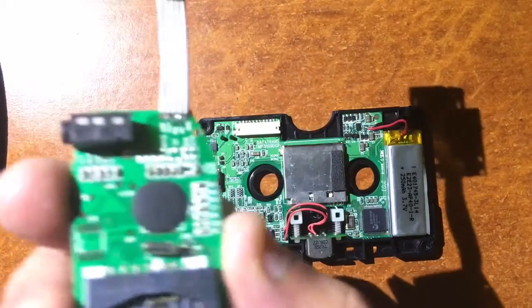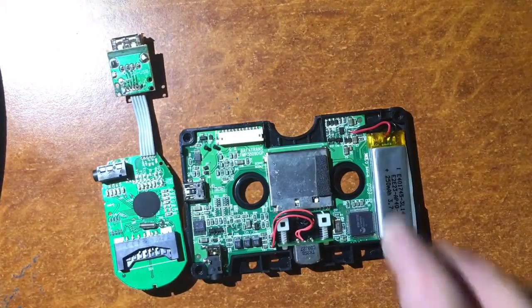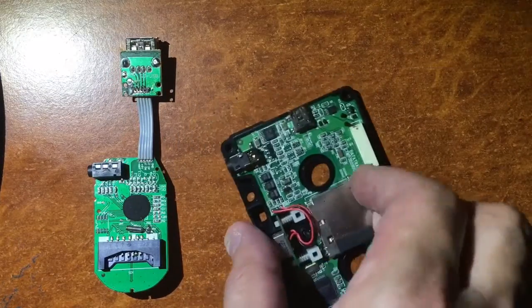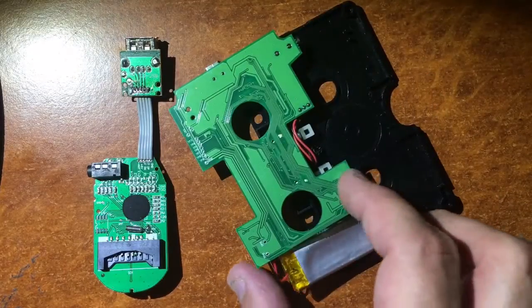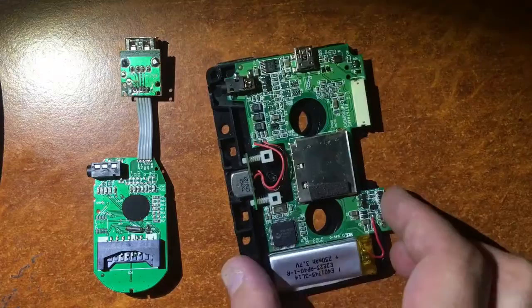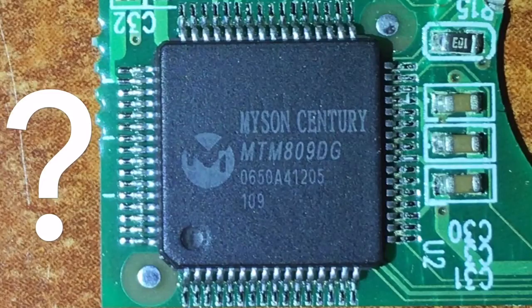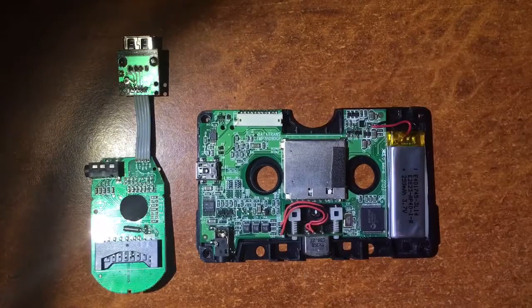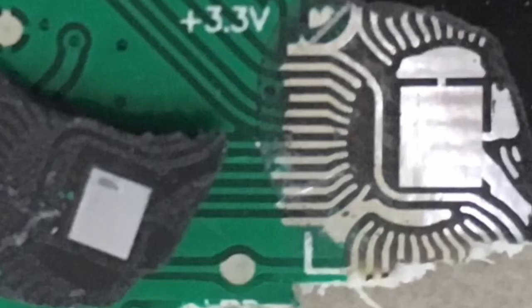The chip on board — not what I wanted to see, it doesn't tell me much. I've already removed some useless mechanical parts in the cassette adapter; it had a few sprockets rolling around doing nothing. So it does have a chip, an SD socket, a LiPo battery — one chip must be doing everything. It looks like a little preamp or something up the other end. I couldn't find any data on the chip itself, which is a bit of a shame. It's a single chip, so it's not the one I'm interested in because the VS1003 can't read an SD card itself.